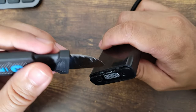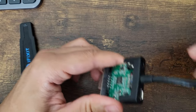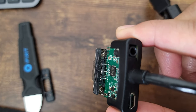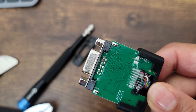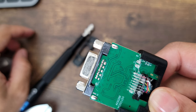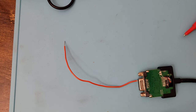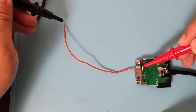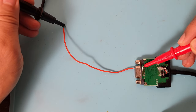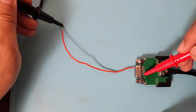Then I need to examine the board to find the areas that represent pins 2 and 13. I first looked right behind the VGA port, and that didn't look like a good way to get to the pins. Then I looked under the board, and these points here look like just what I need. I just need to find out which one represents pin 13 and which one represents pin 2. To do that, I take a multimeter and check continuity between these dots and the pins on the VGA port. To help me get inside the VGA port's pins, I used a wire with the core exposed on each side. I inserted one side into a hole on the VGA port, then took one probe of the multimeter and touched it on the other side of the wire. The other probe was used to touch each point on the PCB. If I heard a beep from the multimeter, then I knew that point represented the pin that the wire was connected to. I only needed to find the points for pins 2 and 13.